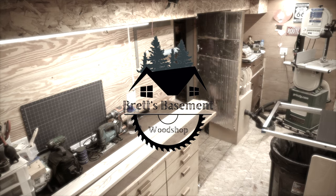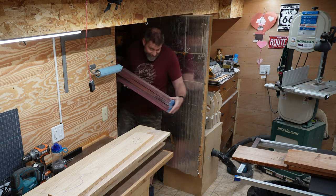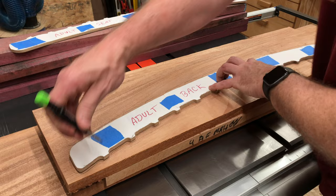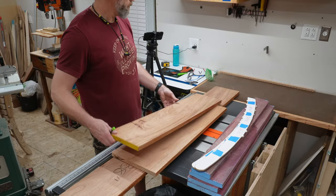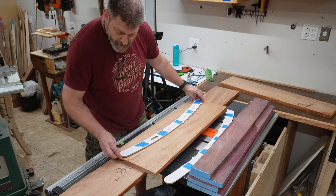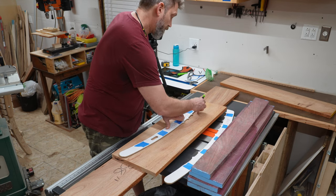I begin by pulling out the boards that have been patiently waiting for me to get around to this project. I'm using ash for the slats and African mahogany for the legs. And for the star of the show, this is what a hundred dollars of purple heart looks like. All material is four quarter, or about one inch thick. This wood is too expensive to waste, so I'm making sure to get the most out of it by laying out the pieces before milling everything down. I made another video where I showed how I made these templates from Jay's free plans — I left a link in the description to both the plans and that video.